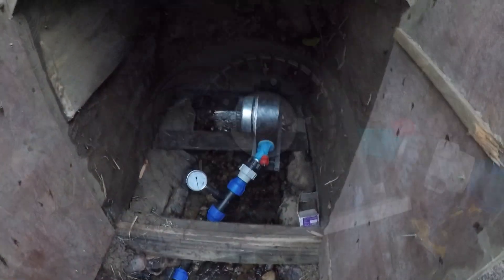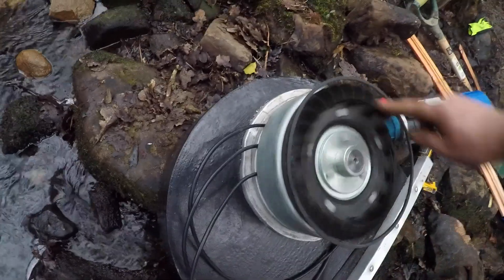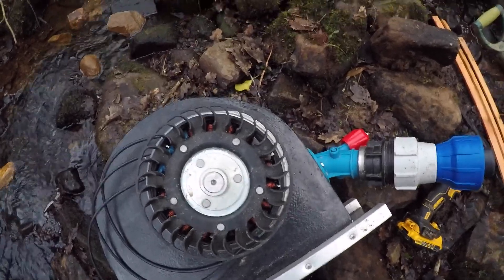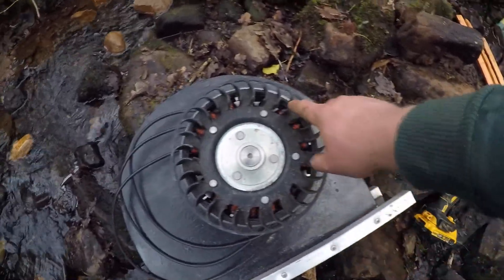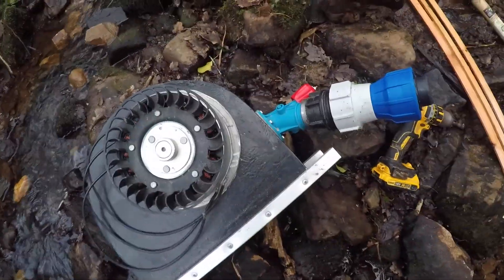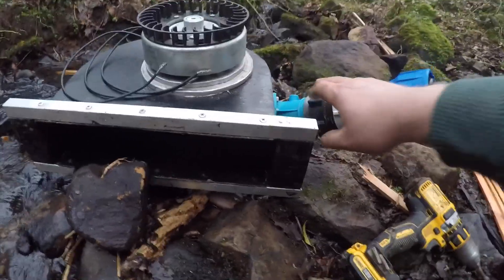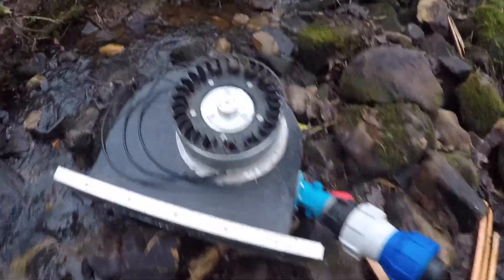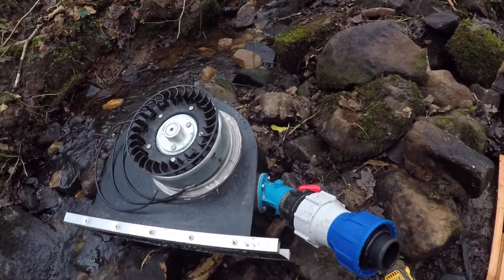One thing I haven't shown you yet is that I changed the alternator for one that spins a lot faster for the same voltage, so now I should have the correct RPM for the head that I've got and for the voltage that I want. This is going to spin at about 2000 RPM — it will make quite a noise. It's also got nice couplings so everything is lined up. I changed the angle of this as well so now the waterjet hits it perfectly where it's supposed to. I didn't make a video of it but it's modified now so all those initial issues are sorted out.